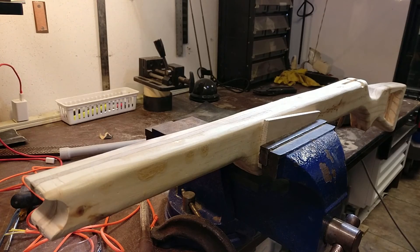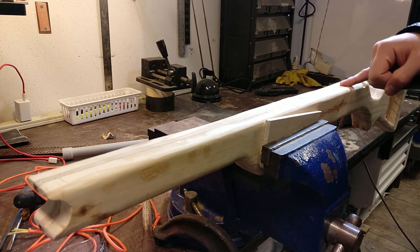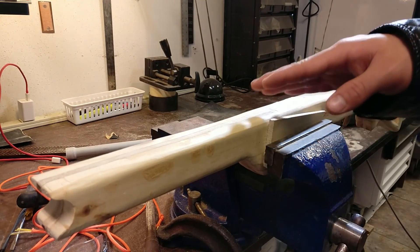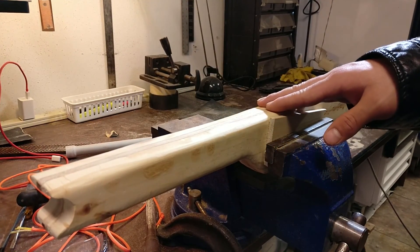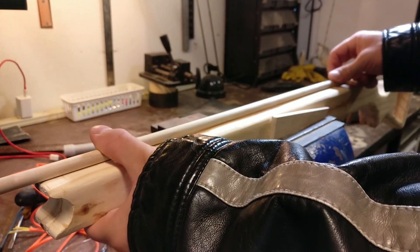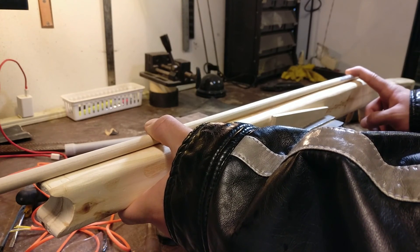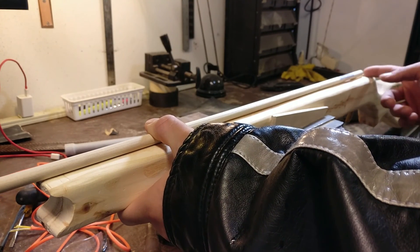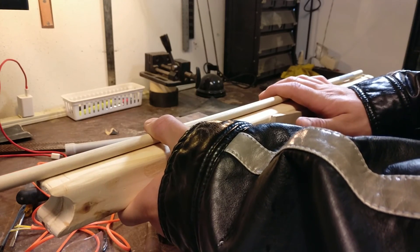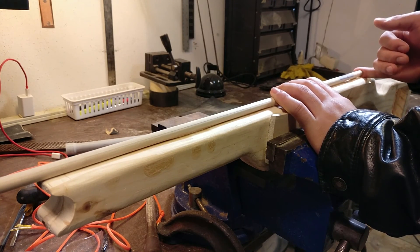The next step for the woodwork of our crossbow body will be making this little notch groove for the arrow to rest in. The reason you want that is because you don't want your arrow rolling off while you're tilting the crossbow or just holding it — you want it to stay in place and not move. Here's the arrow wooden dowel we bought at Lowe's so we can get an idea of how much of a notch we'll have to make. You don't want it to be half a circle — just a bit under half, because that gives the string less area to hit if you make that notch too deep.